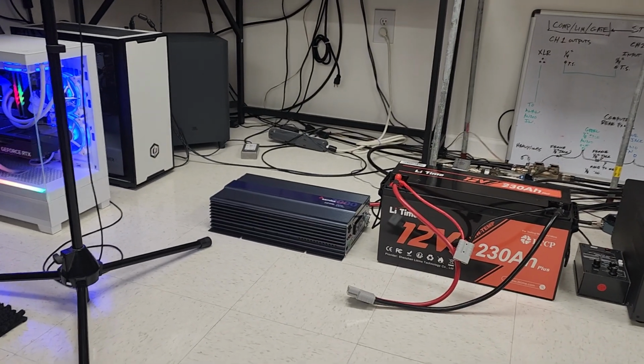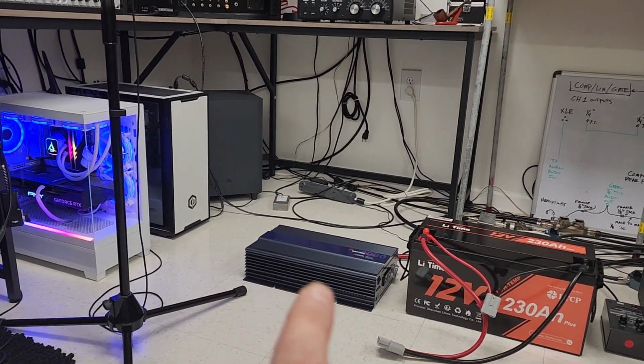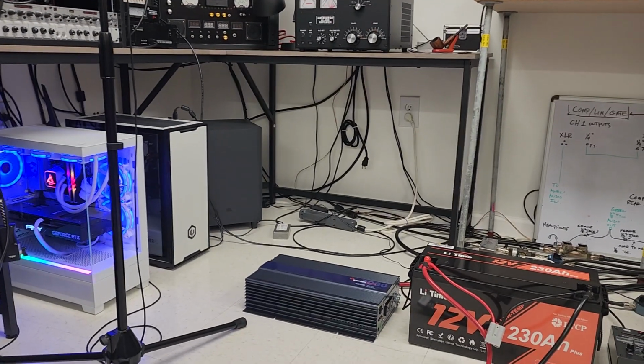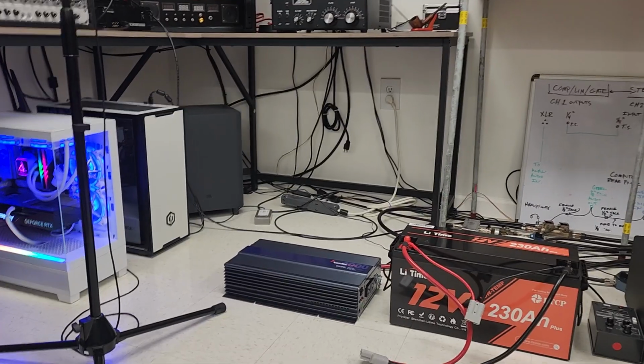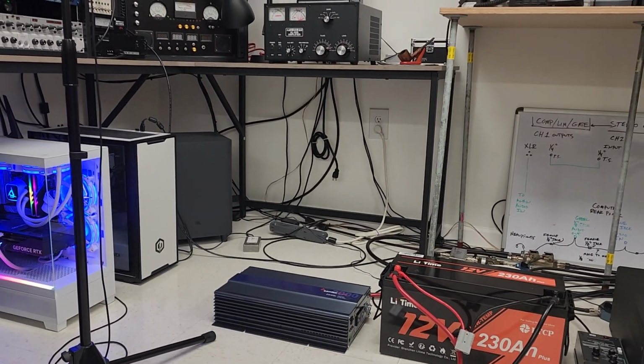Next step, he shut the mains down to his entire house. So the only thing that was on was the station and the power inverter. Okay, so we turned on the receive, and that interference was gone. That eliminated a gigantic chunk of the possibilities of what it could be. So now he turned all the breakers off, turned the mains back on, and I was in his radio room watching the screen.